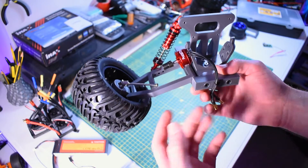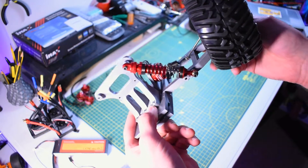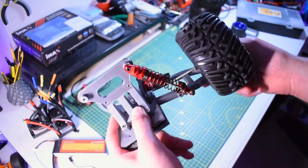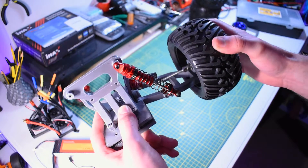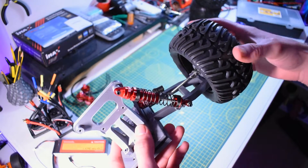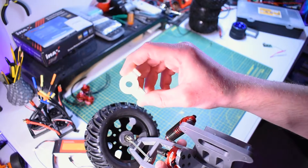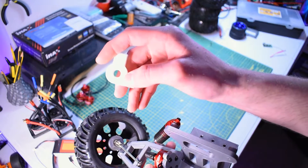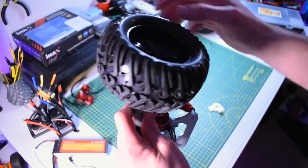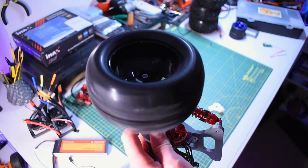The main purpose of this draft was to see how the suspension behaves. You can see as the suspension arm lifts up, the shock absorbs it — exactly what you want. You'd be driving along, hitting bumps, and the shock takes all the impact. It works really nicely, though the springs are quite stiff so I may need to change them out — I won't really know until I know the full weight of the car. I've also added a bearing into the knuckle, which reduces friction so the wheel spins freely. Without the dog bone attached, you can see it spins very freely — that means the motors don't have to work as hard.